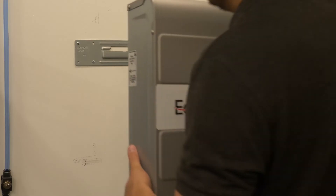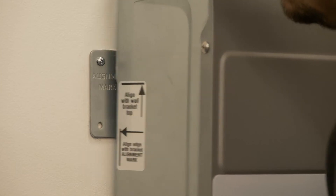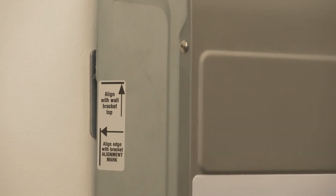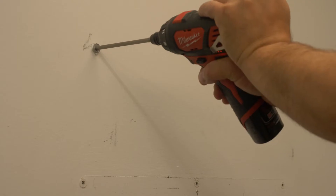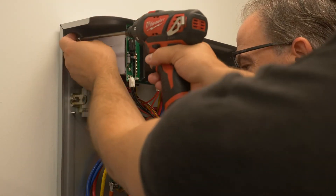To mount the unit, align the left side of the heater to the alignment mark on the mounting bracket as shown and slide the heater completely to the left. Install the locking screw through the back plate and into the mounting bracket. Mounting the heater in an alternate orientation is acceptable. When doing so, do not use the included bracket and ensure the fittings are facing to the right as shown. Note that the display readout and buttons will not rotate to accommodate for this alternate orientation.